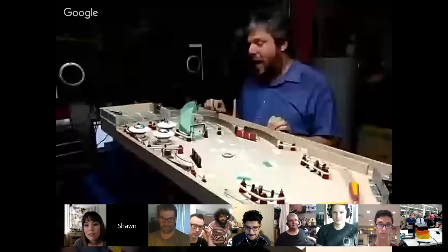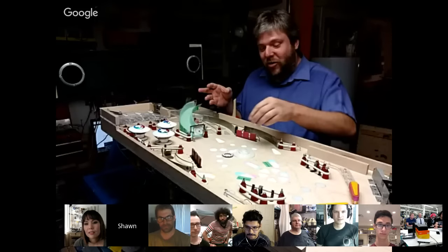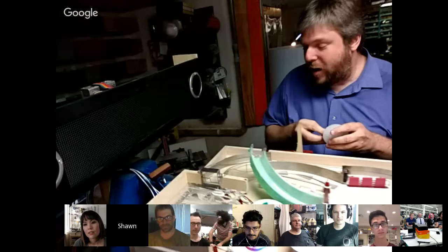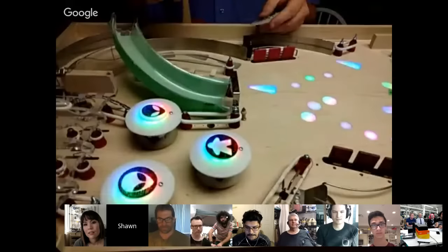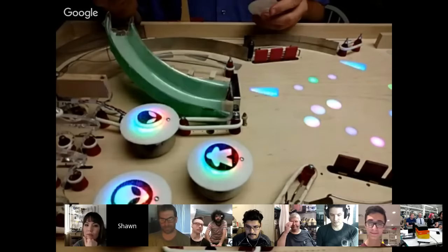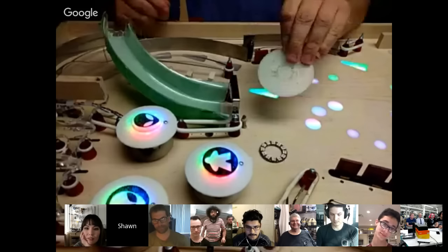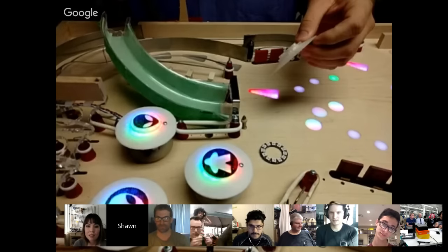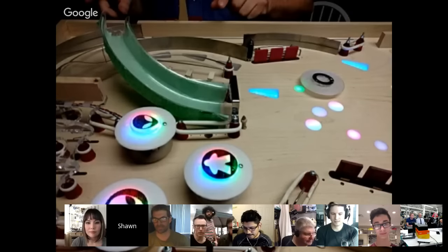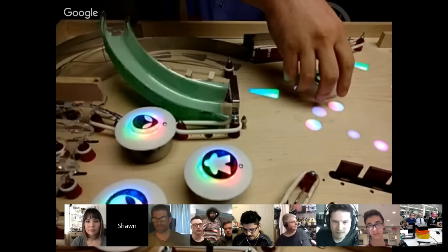We wanted to demonstrate today some NeoPixel rings that we've mounted in the pop bumper caps. This is called Mission Pinball, and they've got a whole infrastructure around using the Fade Candy board and NeoPixel rings to light up. We've got these 12 pixel NeoPixel rings, and they fit inside the pop bumper cap. So we've got a mode in the machine where the player needs to hit each pop bumper 12 times, and you can tell the player exactly how many times.